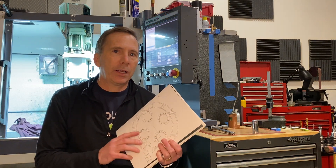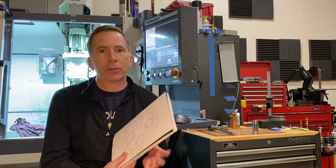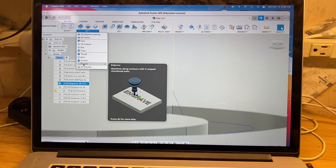What I'm really going to focus in on is how to do the engraving — how to do the engraving using the function in Fusion 360 with a CNC. There are a couple of tricks I learned because the way the function works typically I didn't like the results. I'll show you some ways you can tweak and adjust it to get exactly what you're looking for. We'll take a look at the engraving function in Fusion 360 — it can be found in 2D machining right here.